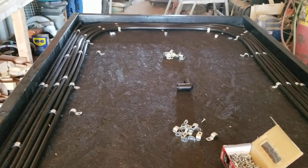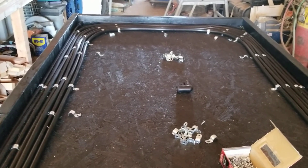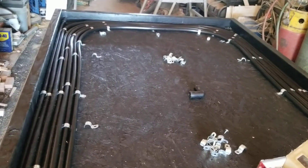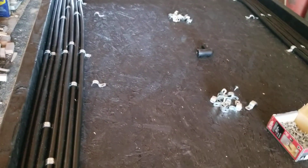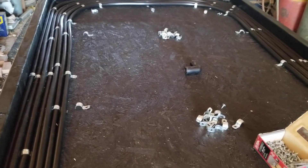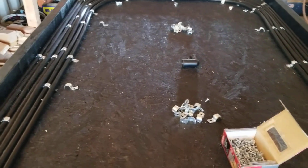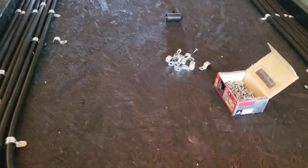What is this solar hot water panel going to be for? I don't need hot water out here in the desert in summer. This is going to heat up the water in the barrels of my water wall inside the garden house for wintertime. The panel will be out in the sun, heating the water in the tubing. Even though it's cold outside, with all the black surface sealed in with glass on top, it'll be like getting into your car after it's been parked outside all day on a sunny winter day — hot inside even when it's cold out.